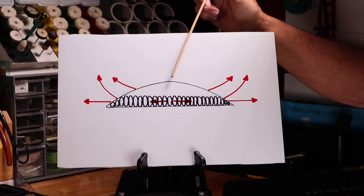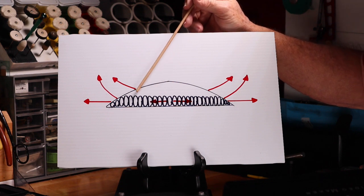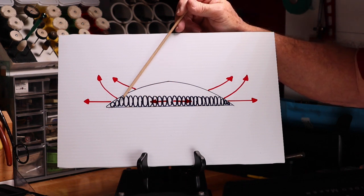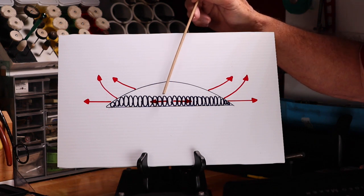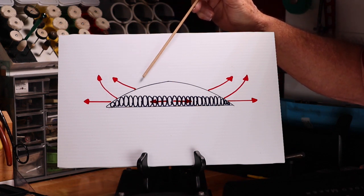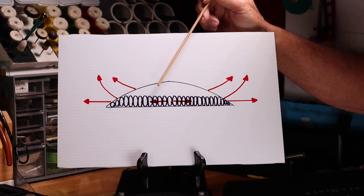This diagram represents a curved piece of metal. The same approach — forging on the lower half — but the big difference is that the resistance and opposing force varies all the way along the length of the curved metal. So when we start forging and those molecules start moving out and curving up, there's going to be less resistance in certain areas, and it's going to start curving and curling up much, much faster than with the rectangular piece. It will actually start curving and curling back on itself. Let's look at both examples in real life on the metal.